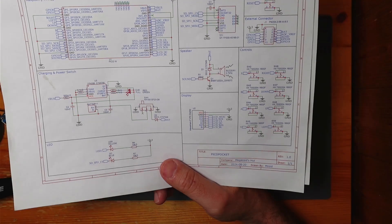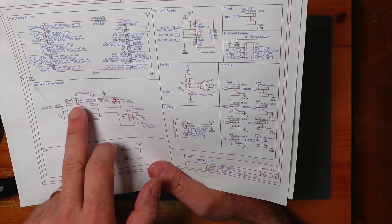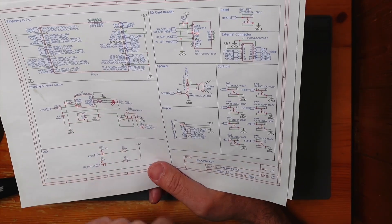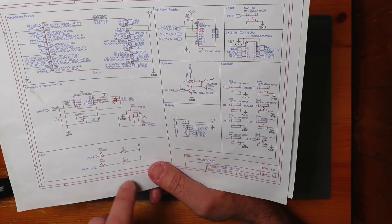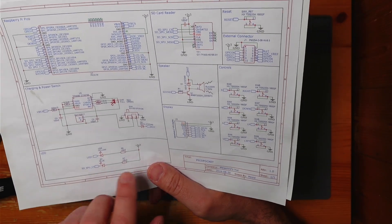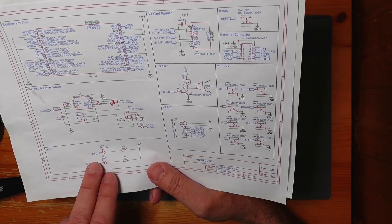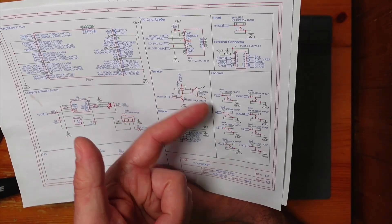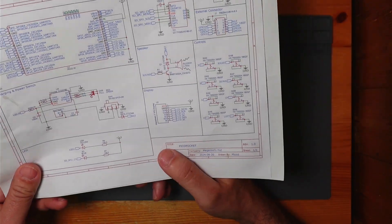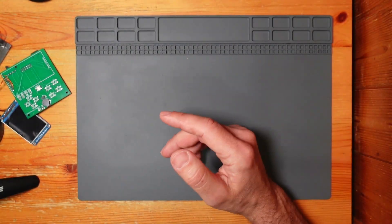This thing is not too complicated at all. You've got your Pico RP2040, a TP4056 for charging, a couple of LEDs for charge and full status, and a couple more LEDs — one for indicating reading from the SD card, and the other is a user-enabled LED. There's a speaker with a little NPN transistor, a couple of Schottky diodes, some buttons, and that's it. Nice and simple.